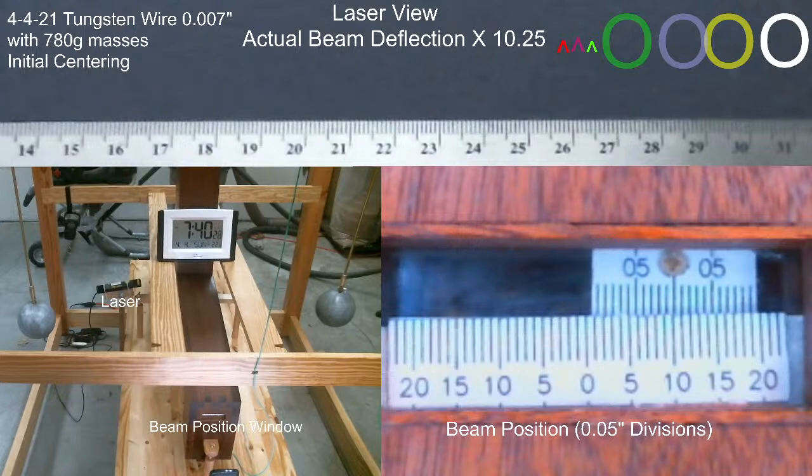I think we're very close to hitting the sidewall on that side right now. That side hits at about 11 because this thing's not hanging exactly in the center, but we need to make the oscillations stop and see exactly where it's sitting before I try adjusting the leveling screws on the cabinet. There's a sequence this stuff has to be done in.